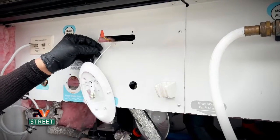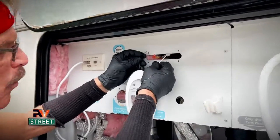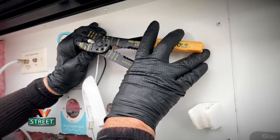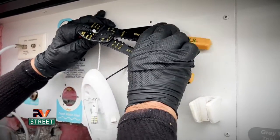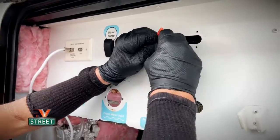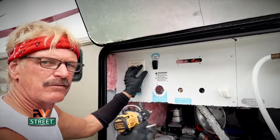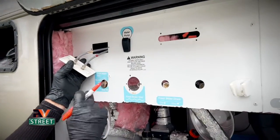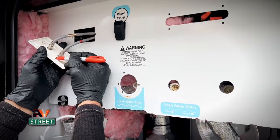Here we have 12-volt wiring — black to yellow and white to white. There's a little crimp-on fitting here. I'll take my crimping tool, rotate it, and crimp it the opposite way to release it. These are not reusable — we'll just put a wire nut on to protect it while we work. Going ahead to take this plate off. I'm going to remove these two cables and make sure I put them on the right post when putting it back. They're marked gold and red, so I'm going to put a red magic marker mark there so I know.